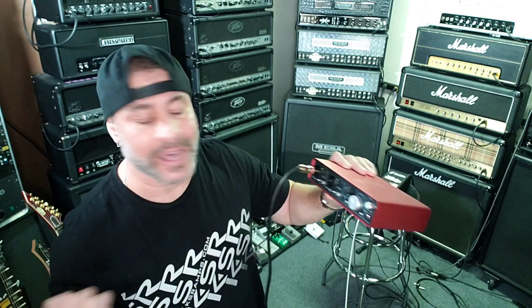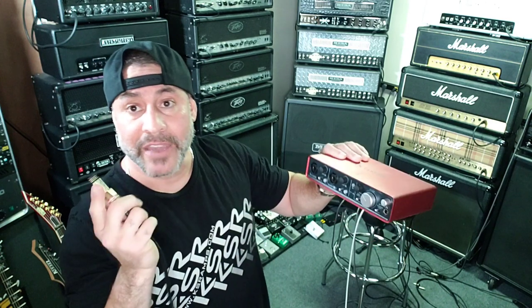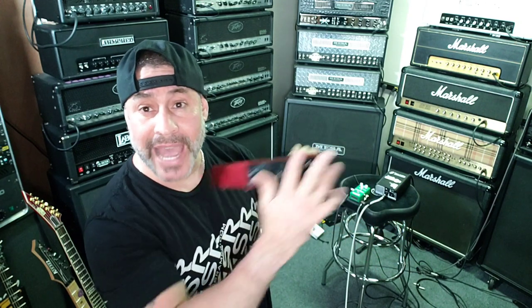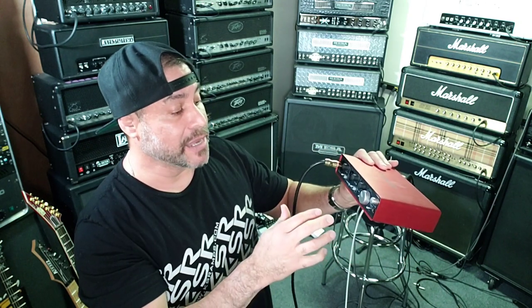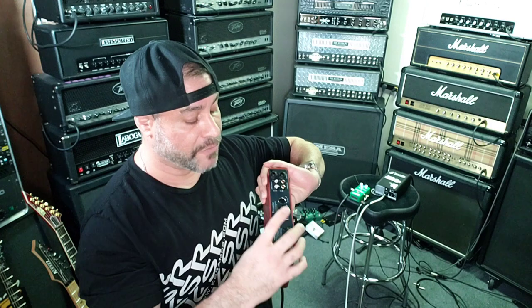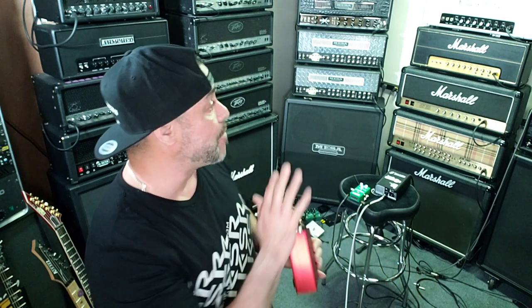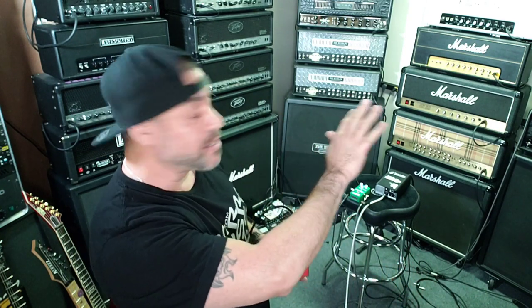You can get any of them. But again, if I didn't want to connect it to my camera, I would just run through here, two speaker outputs out to my monitors, and of course, USB out to your laptop, and you can open up whatever DAW you're using, and that's where you end up hearing it. So that's how you're able to convert analog into digital and have it run into your computer, or again into a mixer if you're shooting anything.